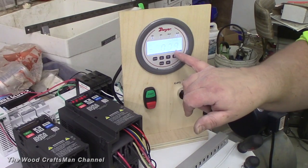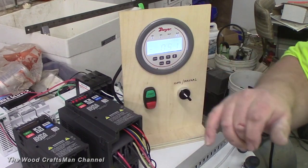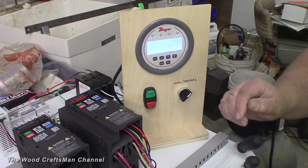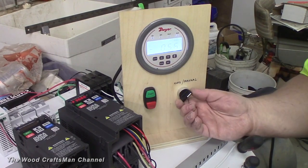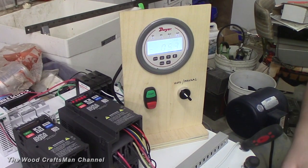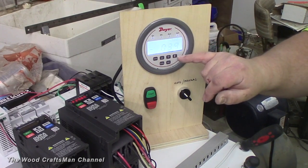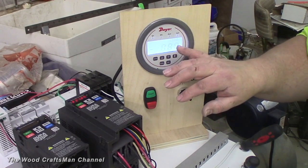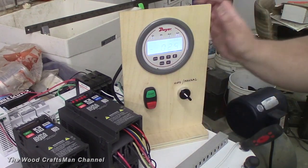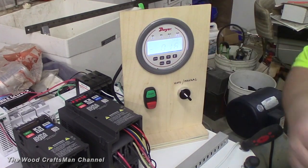When these numbers go up and down, it's actually adjusting the frequency accordingly. In manual mode I just run at 30 hertz. In auto it speeds up and slows down to maintain the parameters. I've set parameters of about 0.02 to 0.03 difference, and right now it's sensing pressure difference through a couple of tubes in the back.